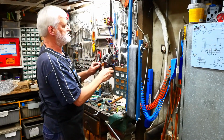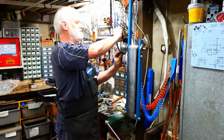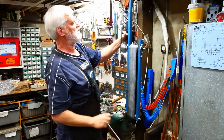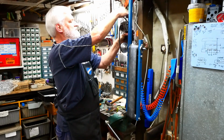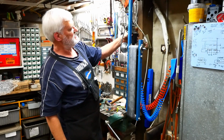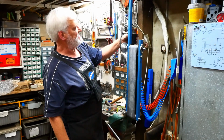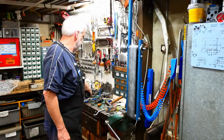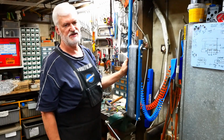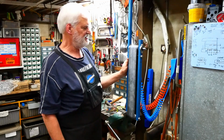But this is a Z section belt. It's pretty much the smallest one I could easily get my hands on. Yeah, so looks like that might be the go. Something like that, with some adjustment for belt tension. And I have to make it so that the motor section here bolts onto the lower section. Otherwise I won't be able to get it through the hole in the side of the milling machine.